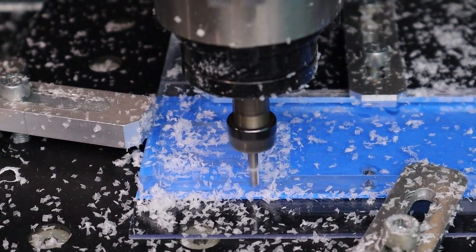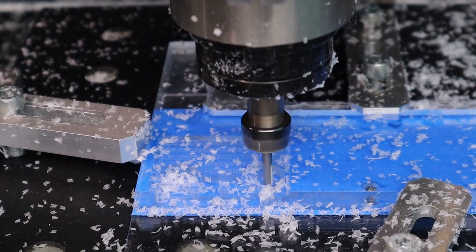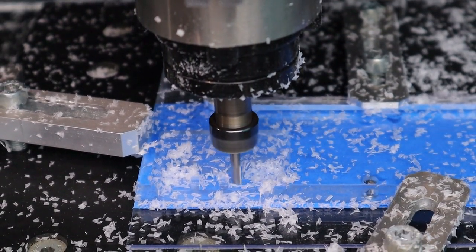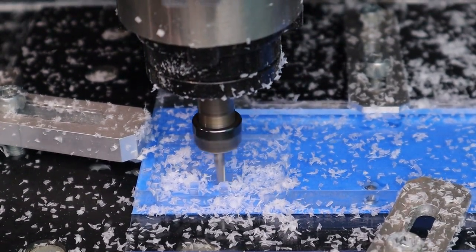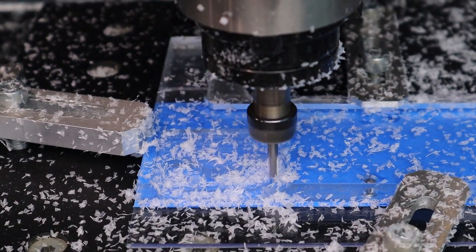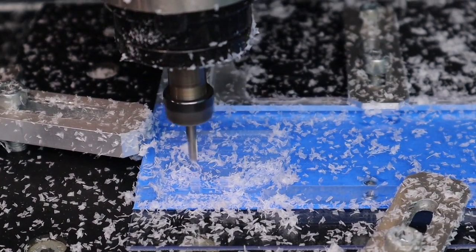To begin with, I needed to finish making the parts for the triggers so I could test them and confirm that I'm happy with the design. These are the final parts of the acrylic housing — the trigger supports. These bolt to the brass inserts on the inside of the rear grip sections and provide a pivot point for the triggers, as well as help separate the shoulder and trigger buttons.